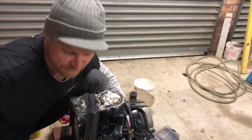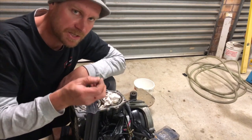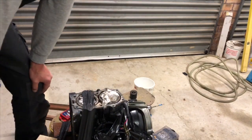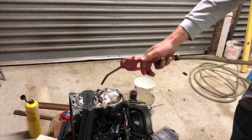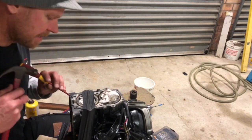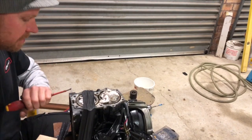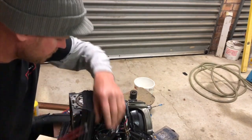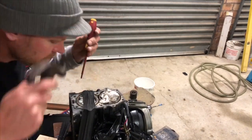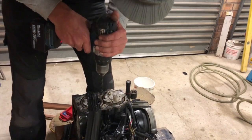Be very gentle, and don't use cheap drill bits — they snap a lot more. You should be pulling shavings as you go. Now I've got the six mil, going up to a seven mil bit. Blow them out — watch your eyes. I'll use a hammer and a screwdriver to see if I can remove some of the bolt remnants. Now this is the size I need before I cut the new threads, so I'm going to take my time and do the best I can.